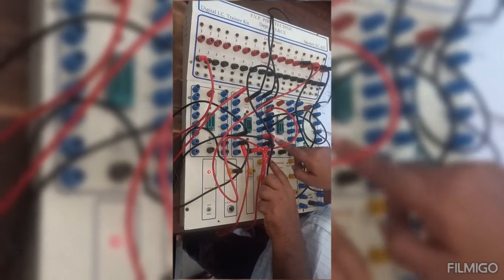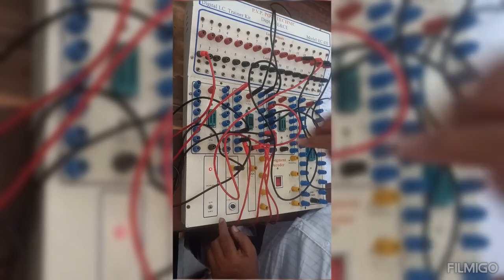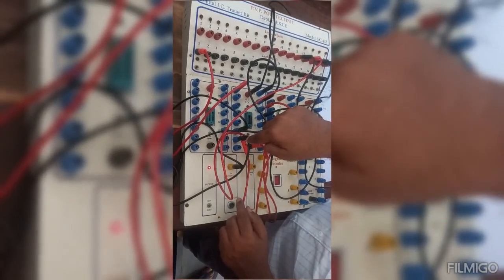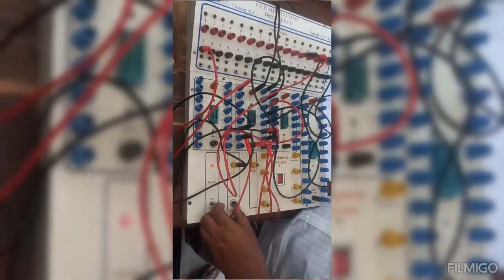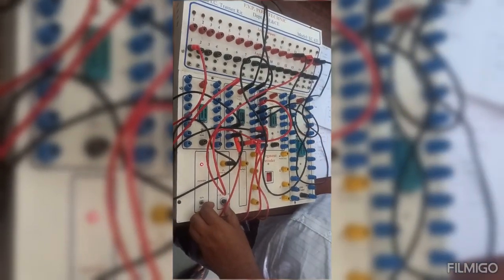Here pins 8 and 9 are shorted together to the clock. Pin 6, which is the mode, I have shorted to pin 7. Pin 7 is connected to the ground. I am not using the mode because I am not using parallel input — only serial input. So mode can be connected to 0 forever.